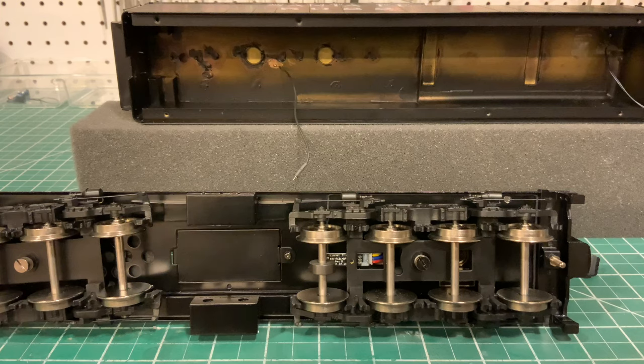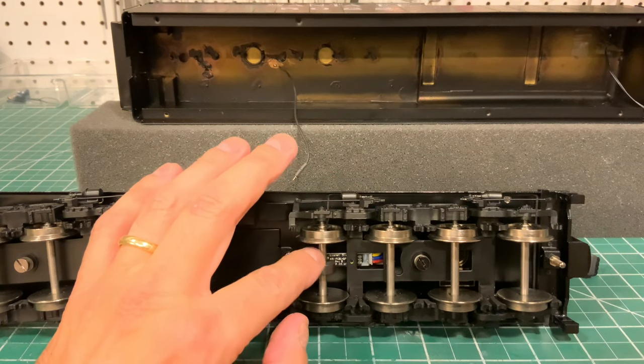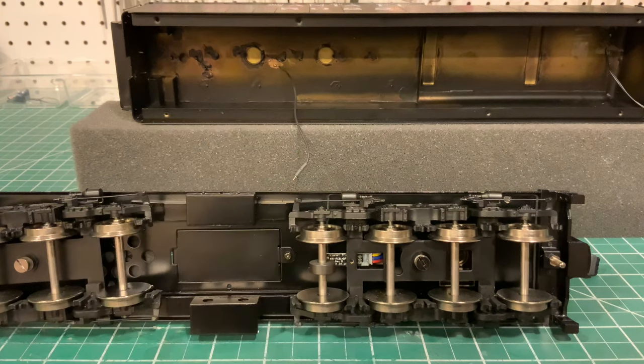When Lionel made their electronics, some of the early TMCC boards, even back in the LCRU days, took either a Hall effect or a kind of cherry switch input, and their boards could deal with a funny duty cycle. It wasn't necessarily a pulse. It was just detection of on-off. So that's why you see people when they do TMCC upgrades sometimes get away with putting a couple of magnets on a set of tender wheels. And the math resolves itself.